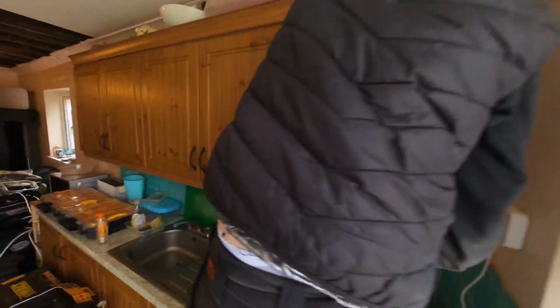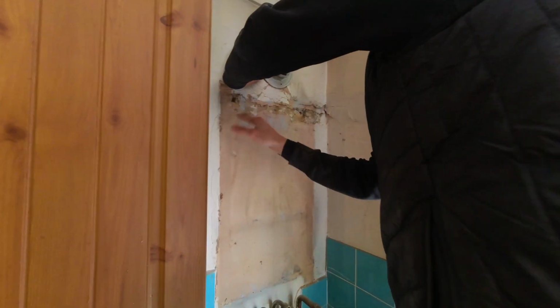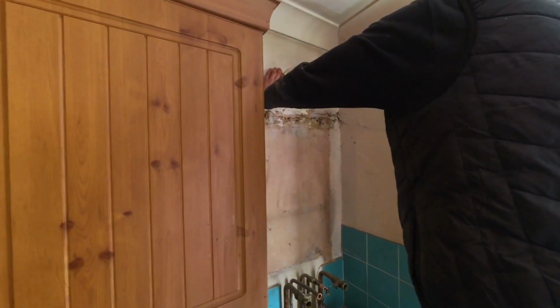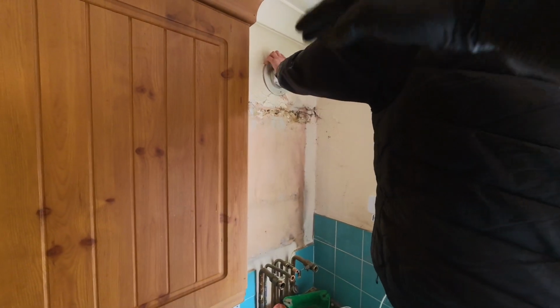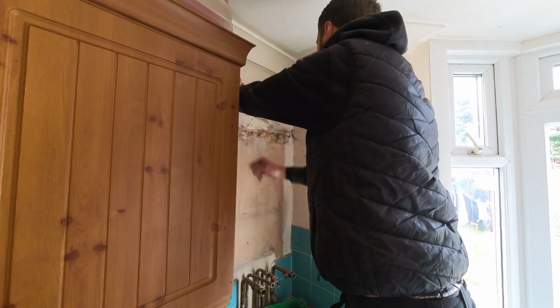So yeah, we're going to have to see where we can get decent fixings. Otherwise, use a bit of resin. Got some Corefix screws. We'll find a way. Hopefully the new bracket will sit higher up because we need to raise the boiler anyway, so we should be able to get some decent fixings. Let's give it a go.